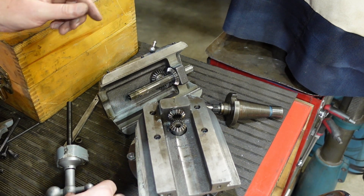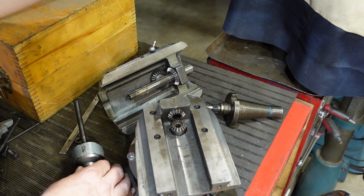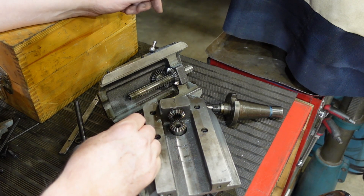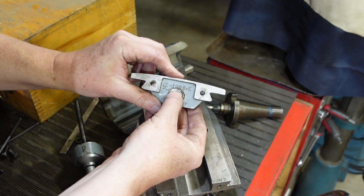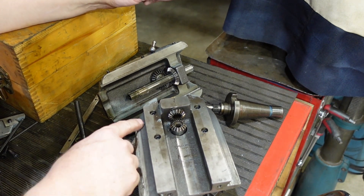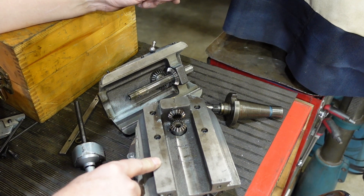It's pretty simple in its construction. The devil is in the detail — a lot of these bearings are actually needle roller bearings. There's a needle roller in there and some up here; that's the end plate, and once again a needle roller bearing. So it's quite well made but it does need a bit of maintenance every so often, and now is one of those times.